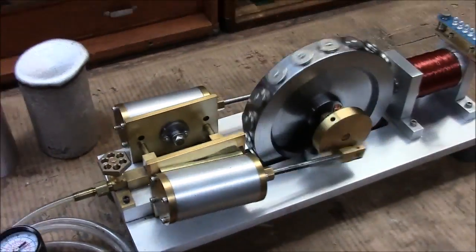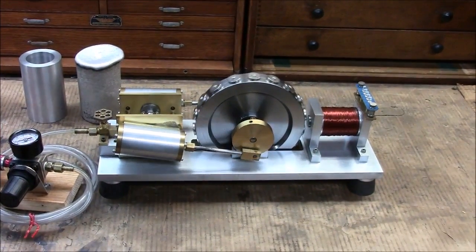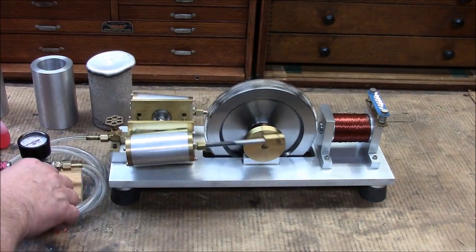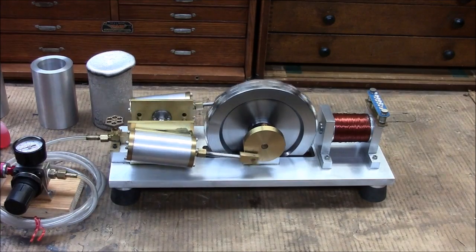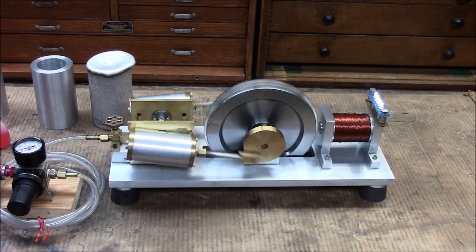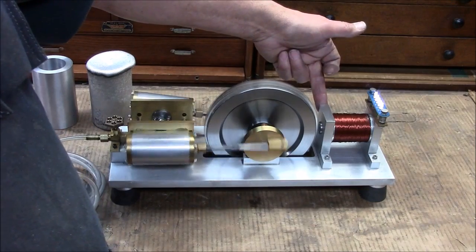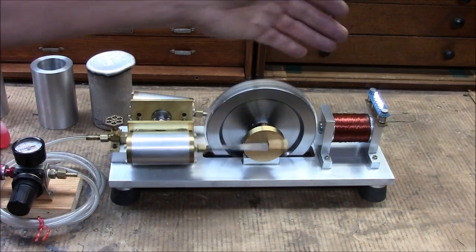Okay, I'm going to put you back on the tripod. We're going to rev it up a little bit. You can see the faster it goes, the brighter the lights. Now that's about three pounds of air. We're going to crank it up to five pounds. At five pounds you can see that the magnets travel past the coil more rapidly, and the lights will now stay on. Persistence of vision makes those lights look solid.